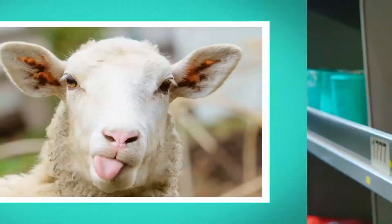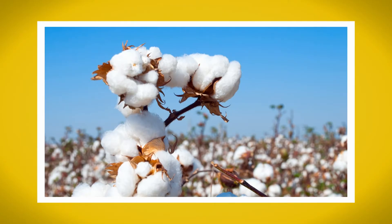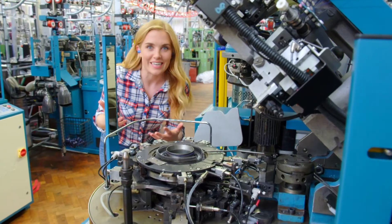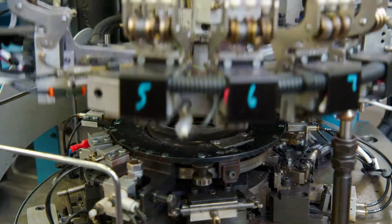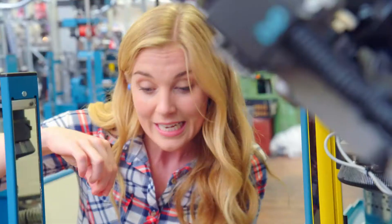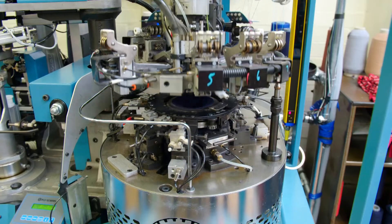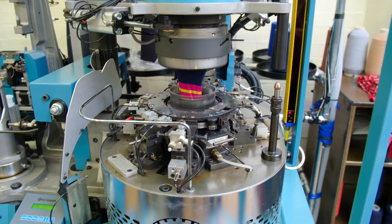Most of the yarn here is made from wool, which comes from sheep, or cotton, which comes from plants. This machine is automated, and that means it works all by itself. That part is where all of the threads are knitted together, and the bobbins are put at the top of the machine. There are 176 needles that work together at the same time, knitting round and round, building the sock up like a tube. They work so quickly they can make a pair of socks in just 9 minutes!